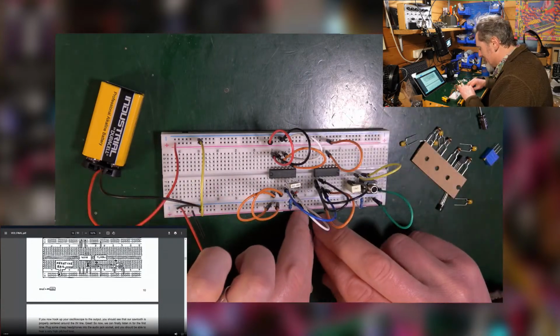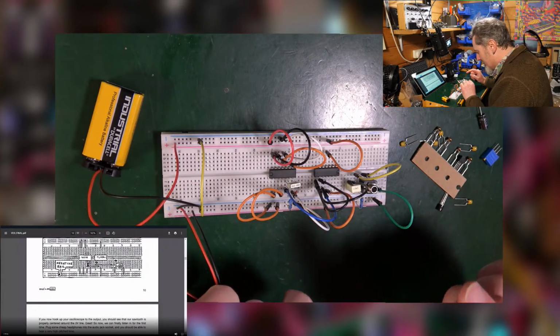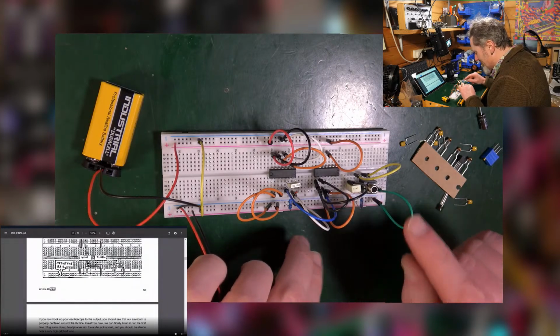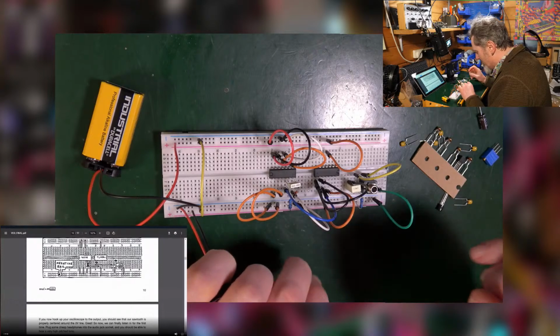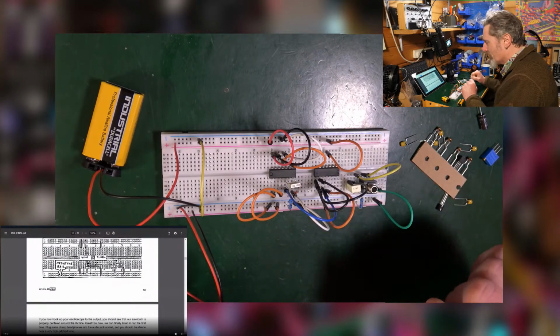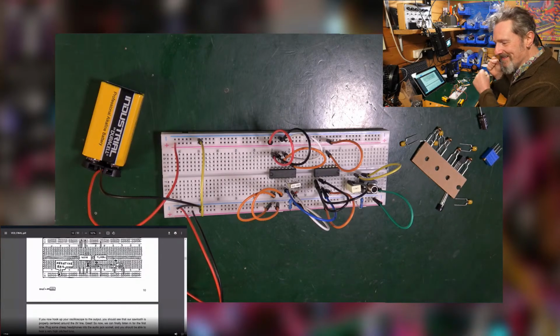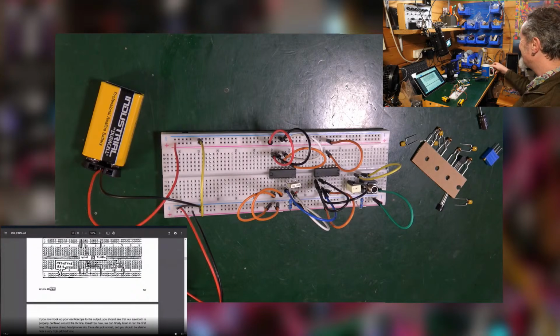I don't understand quite exactly how it does that, but that's by the by. That's what it does, and that's bringing the signal over here through the AC coupling to remove any offset so that it's nicely oscillating around 0. That gives us our waveform output. Oh yeah. Yes. Oh, I wish I'd brought the beer now.